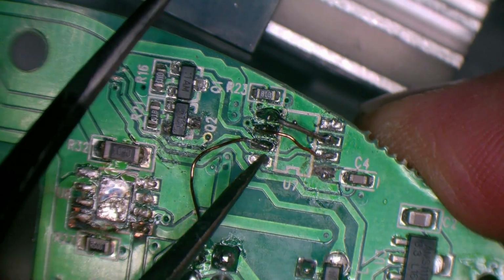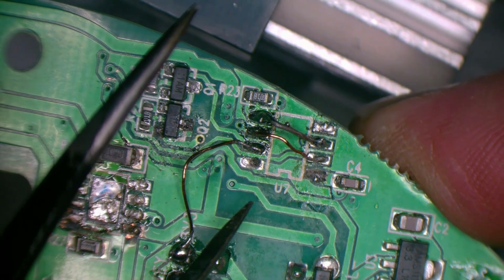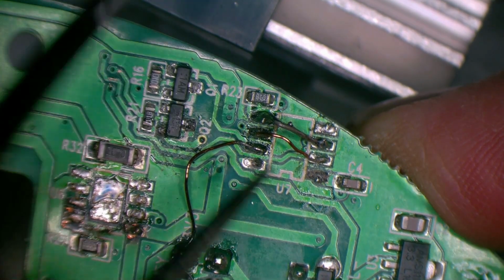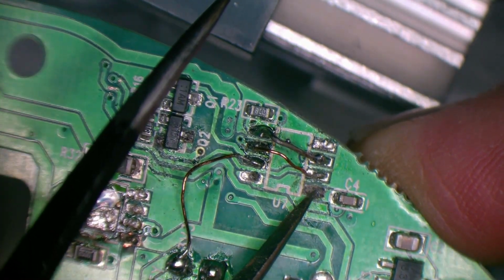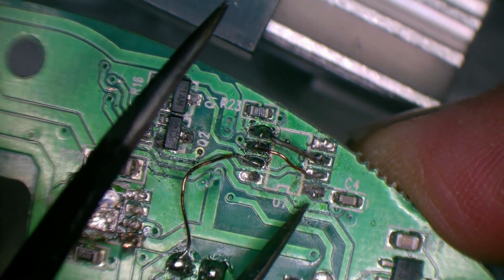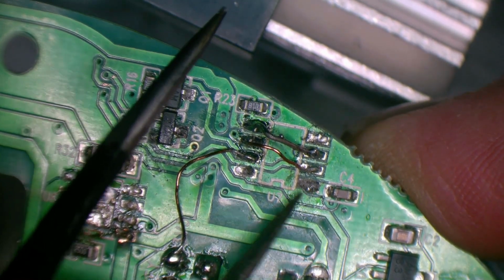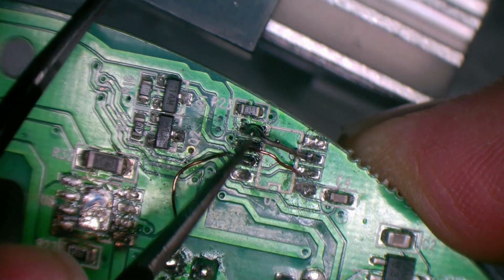So I've looked for ICs that might do this, things like buffers, inverting Schmitt buffers or something like that. I can't find anything in an SOIC8 package that has VCC and VSS, so you've got your voltage plus and minus ground over here, that has 3 inputs on those pins and 3 outputs.